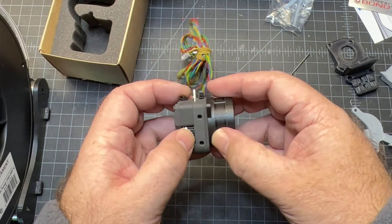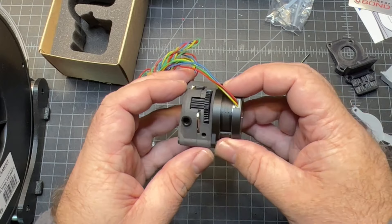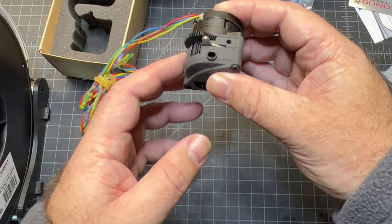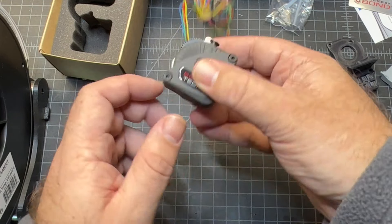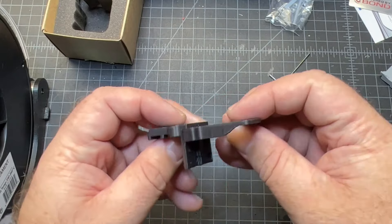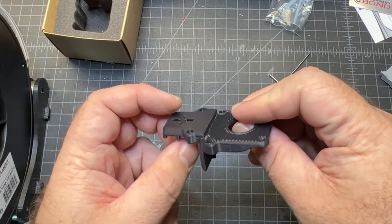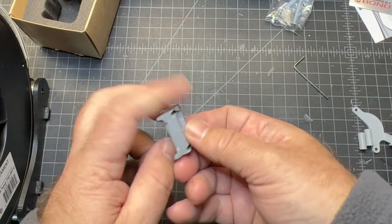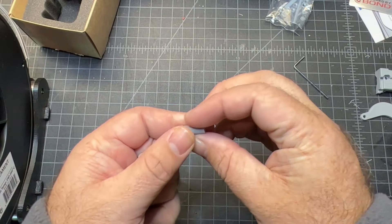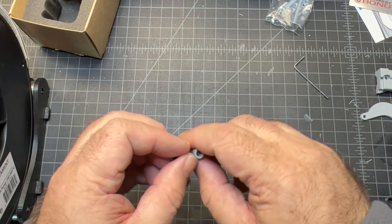You can see the reason they call it the LGX is because it has larger gears — pretty good size gear there. The nice thing is it's already pre-assembled, so it's basically just going to sit above the hot end, and the hot end is going to line up right here. This is a little challenging part — you can see you need to print it with supports. This part also sits on top of the carriage, and you're going to have to rerun your belts. You'll need to print a new zip tie relief, and you'll need two pieces where you put in heat inserts — these go between the motor mount and the back of the strain relief.